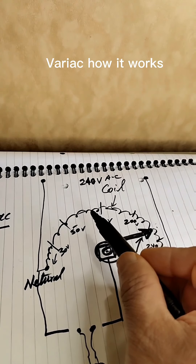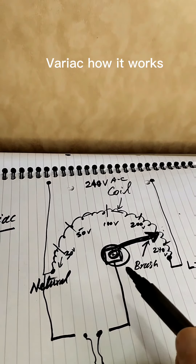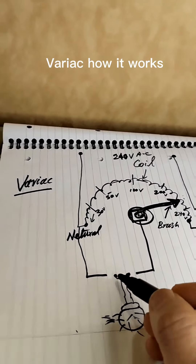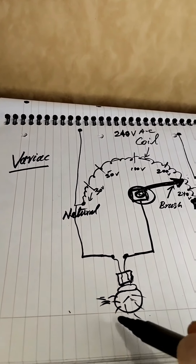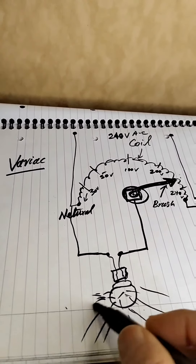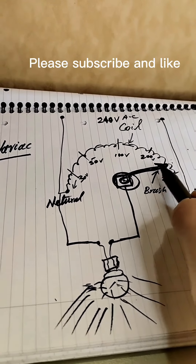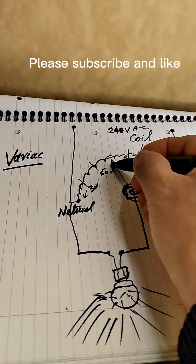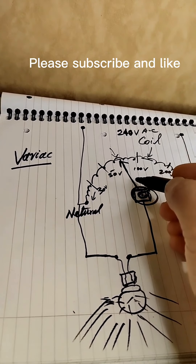So now it is on the full 240 volts — the needle is at maximum. As soon as I keep turning back, the resistance carries on increasing and the voltage keeps dropping. So this is picking up from the coil and going into the light. The other side is neutral. So this is not an isolation or isolated variac — this is just a straightforward one. It still could be very dangerous. One side is neutral straight down and the whole wiring is one coil — and it's picking up the voltage from there.